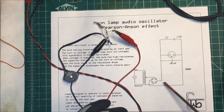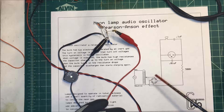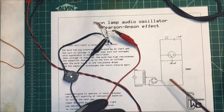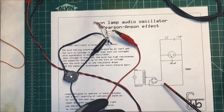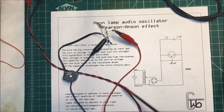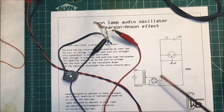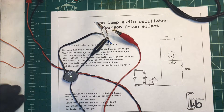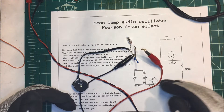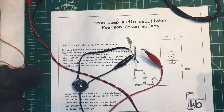You've got to be very careful. I'm not going to put my oscilloscope on here to see the waveform — it's probably a sawtooth — because wherever I put the oscilloscope ground, it's grounded, and I can't tie it to either side without wrecking the oscilloscope. I'm going to get an isolation transformer and put it ahead of this so we can work on it safely. Be very careful with this kind of circuit, because both sides have potential to ground.